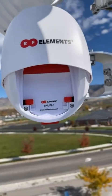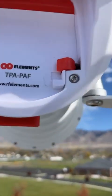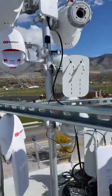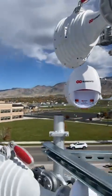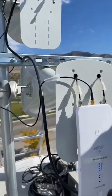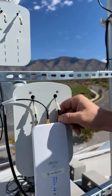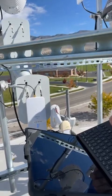When you just jam the radio up into these twist port adapters, you are connecting to RP SMA connectors right there — they're just hidden under the plastic housing. So you're not properly torquing your connections, and you're going to get variability just from that. We see that with actual RP SMA cables: little bumps in the cable when they're not properly torqued will change the signal levels of connected stations along with the corresponding modulation rates.